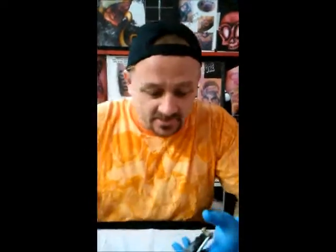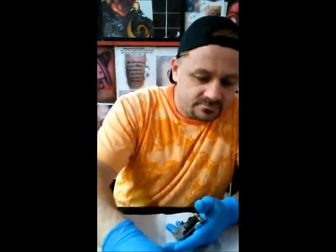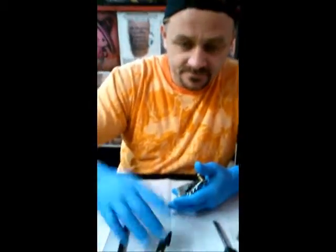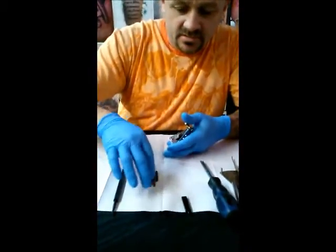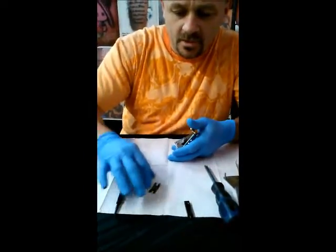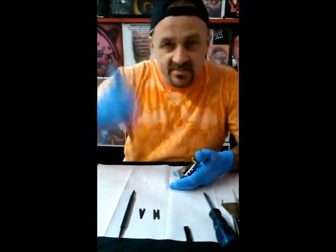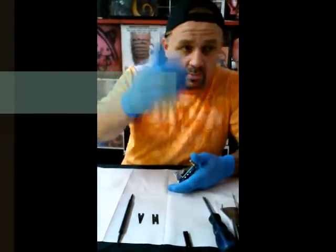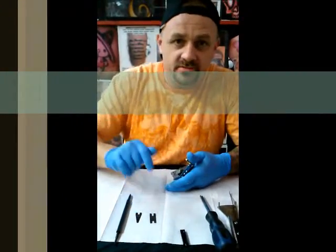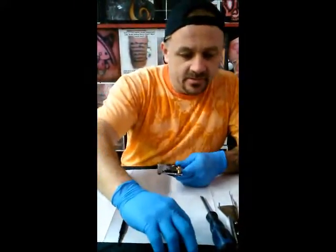Now I'm going to go over a couple quick tools that I use to tune up tattoo machines. In this video we're going to be changing springs. Liners always have short front springs and short rear springs. Think of a diving board: the farther out you go, the more bounce, and the farther back you are on the diving board, the more rigid it is. Short front and rear springs, and a good gauge of spring, is going to make a big difference. We'll talk about that later.